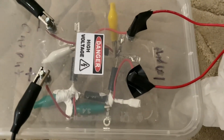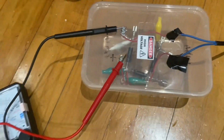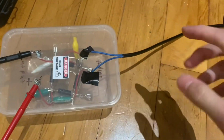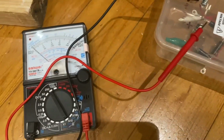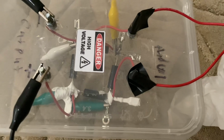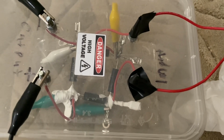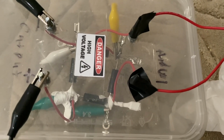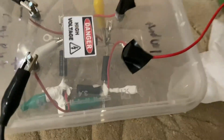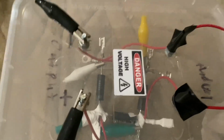And this is the full bridge rectifier. So that's how it is, and I have it connected to these screw terminals. The AC is connected to these two. Turn it on. Okay, so that's the DC voltage. It just uses 4 high voltage diodes that were taken from a microwave, and I think it's rated at like 20 kilovolts, something like that. So there's no way I'm gonna actually exceed that. So yeah, you see the input is there, and you get the DC voltage out.